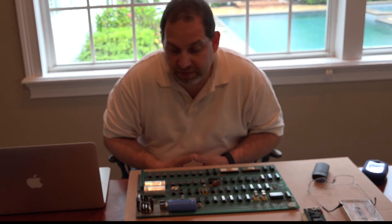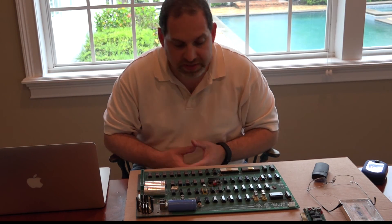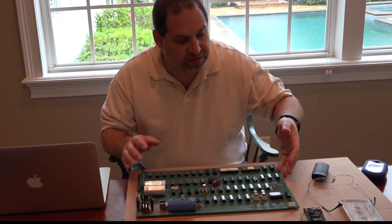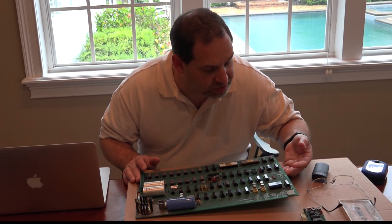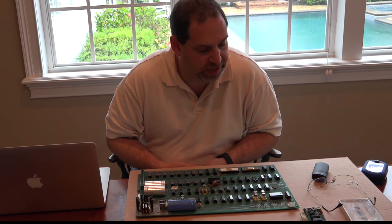The regulators, all the caps, all the big electrolytics — not just these, but the other ones — and this 7404 for the 6800-only at C1 doesn't look like it was ever removed; it just looks like it was never soldered in.